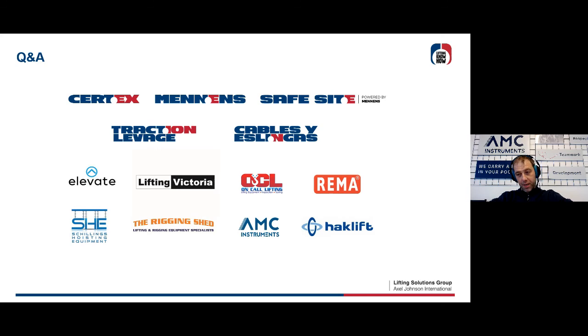The only thing that the MRT is not able to detect is a decrease in the diameter of the rope, especially when it is smooth. If you have a decrease in diameter that occurs immediately in a certain zone, maybe the diameter passes from 20 millimeters to 19 millimeters. This creates a sort of distortion on the rope itself, and this leads to a certain kind of graph. While if the decrease is very, very smooth, the system is not able to detect it.